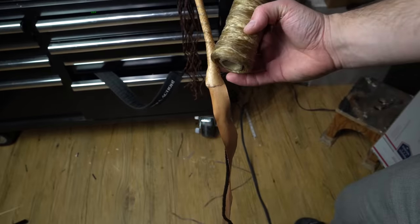So we just slide the blade in like this. There's a little washer and a little notch there on top. And then we just tighten it up like this. Nice and tight. And that's ready to go. Now we just have to get our width right, our thickness with the wheel, and we're good. I got my calipers here. And then I'm just gonna cut a little test piece.